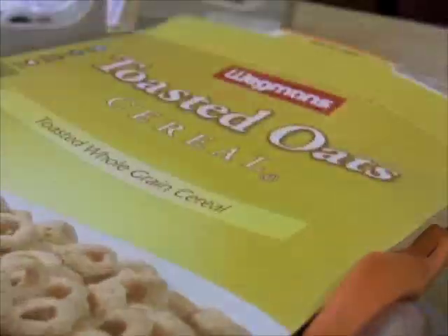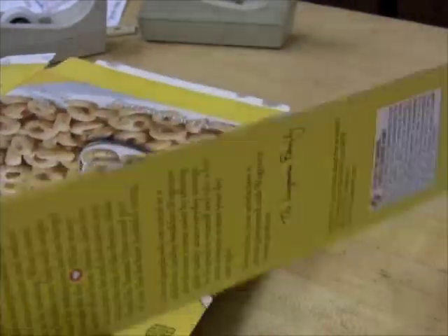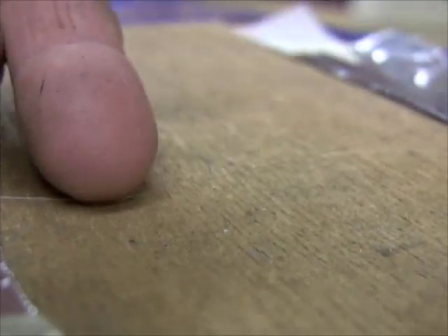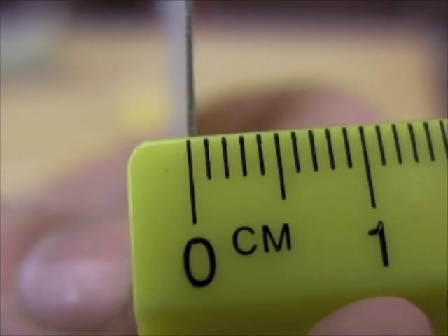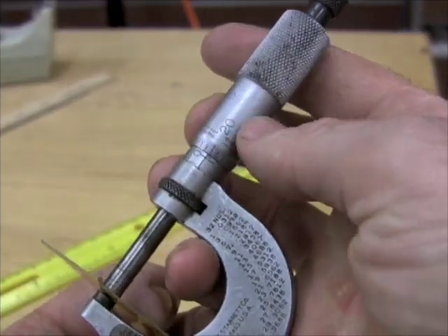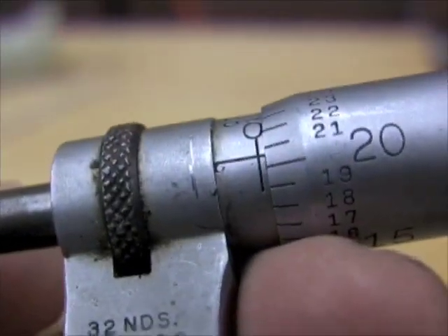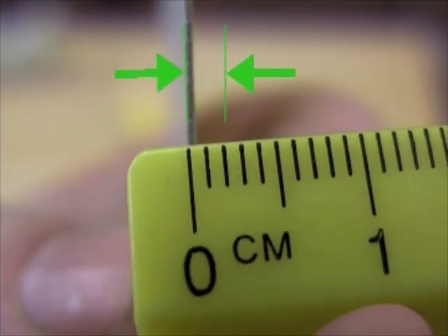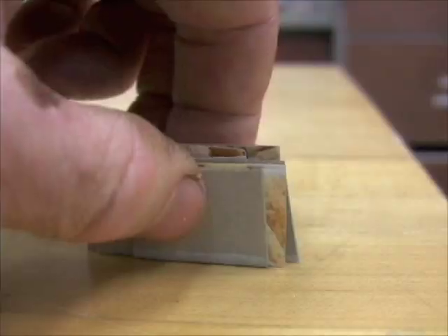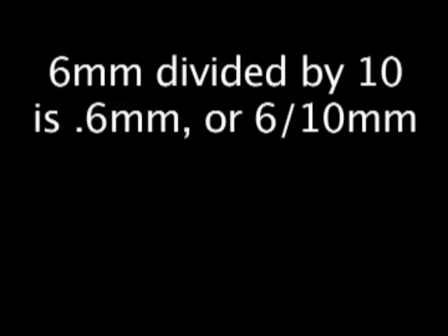The plywood needs to be up off the table more than an inch or 25 mm, but we can just use some books. By happy coincidence, thin cardboard that breakfast cereal and all sorts of food products are packaged in makes a perfect spacer between the plywood bottom and the hot wire, so it slices foam to just the right thickness. When we get into very thin measurements, it can be difficult to measure with a ruler. There are special tools like a micrometer, but there is a cool workaround if you have a metric ruler — what if you increase the sample by an order of magnitude? If we took 10 pieces of cardboard stacked together and it measures about 6 mm, then just one piece of cardboard must be about 0.6 mm.